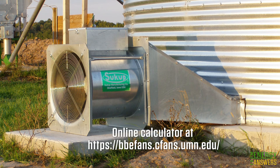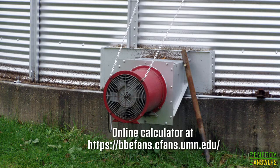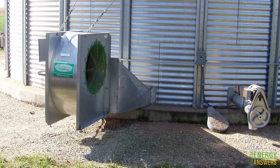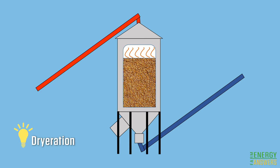About 0.1 percentage point of moisture can be removed for each 10 degrees Fahrenheit reduction in grain temperature. To avoid bottlenecks, size the fan in the cooling bin so the grain is cooled at the same rate as the dryer capacity and keep it running continuously until the corn temperature is cooled to within 10 degrees of the average daily temperature. In-bin cooling can reduce energy costs by 10 to 15% and also increases the dryer capacity by 30%.